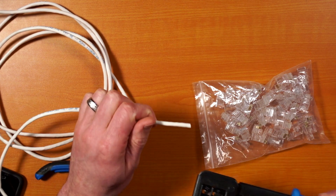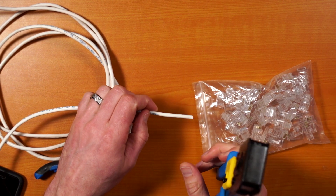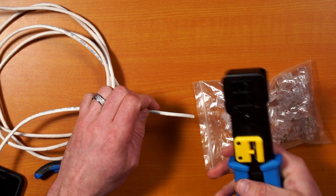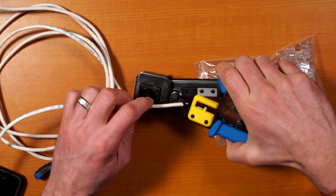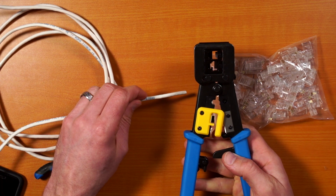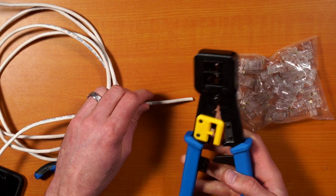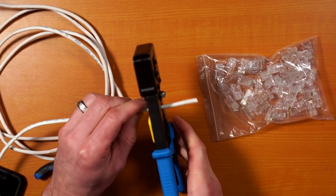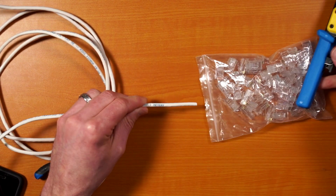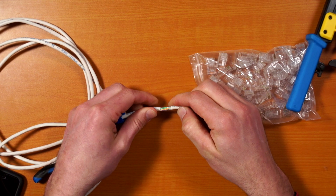Next, strip some of the jacket off the end of the cable. You want to strip off a decent amount — this is not a time to get cheap and try to save cable. Cable is relatively cheap and giving yourself extra will make this whole process go a lot easier. Everything you need is on the crimping tool. There's a little space right here — it's made for exactly regular Cat5 depth. If it's Cat6 it might actually cut into the wire, so be a little careful. For regular Cat5 you just slip that in, get to the length you want, snip, push it down, do a little spin, and let it go. You should get a nice clean cut and that should just pop right open.